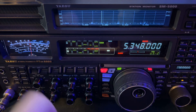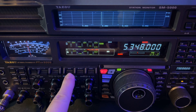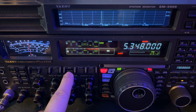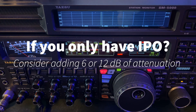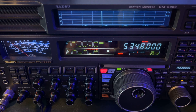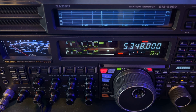I'm using amp one right now. I'm going to go to IPO. This radio has two levels of IPO — this is IPO one. Now let's listen to it with the amp. IPO one. IPO two. IPO two is producing similar results that the QRM Eliminator did. Because I just lowered the gain in the early stage — in fact, in the first mixer stage of the receiver.